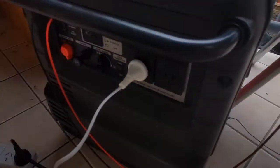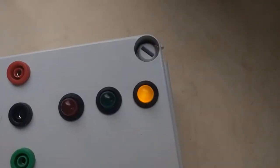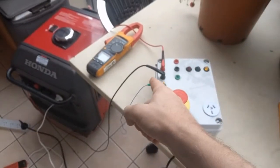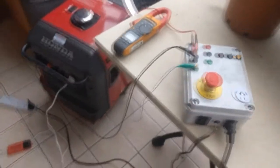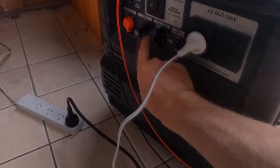Downlights are plugged into the generator here. The yellow indicator is showing that mains power is present. The generator is not running but the interlock is closed, so power from this side can't get to the other side — and vice versa. To prove the generator is running, okay...